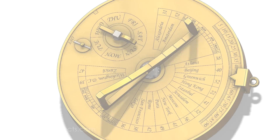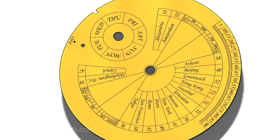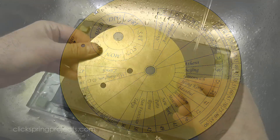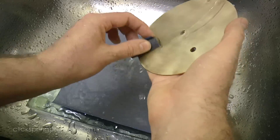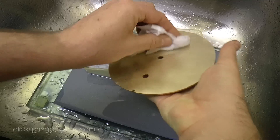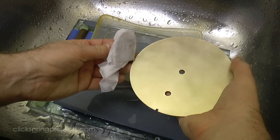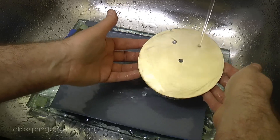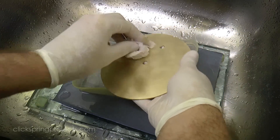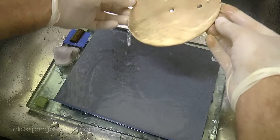Next up is the first etching of the workpiece, and I've decided to start with the front dial of the mechanism. As always, cleanliness of the surface to be etched is critical, to ensure that the photoresist film bonds well to the underlying metal. I start by scrubbing the surface with 400 grit abrasive under flowing water, then use paper towel with vinegar, and finally acetone, to make sure that the surface is both clean and clear of any alkali contaminants. The surface isn't sufficiently clean until the paper towel is no longer collecting particle residue, and water must easily sheet off the surface.